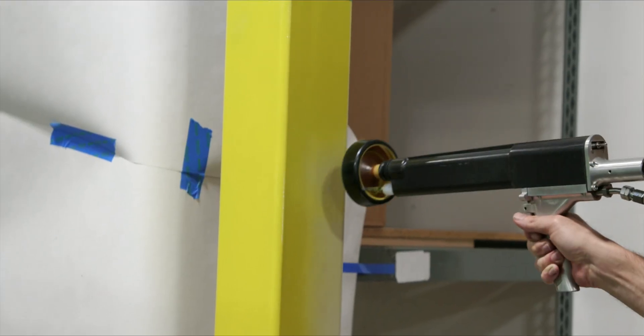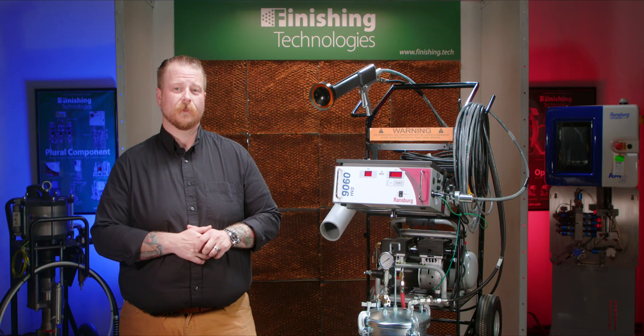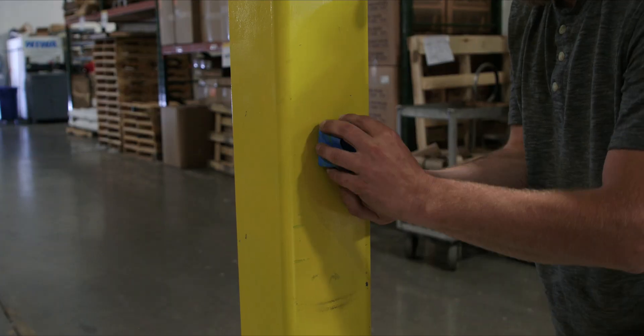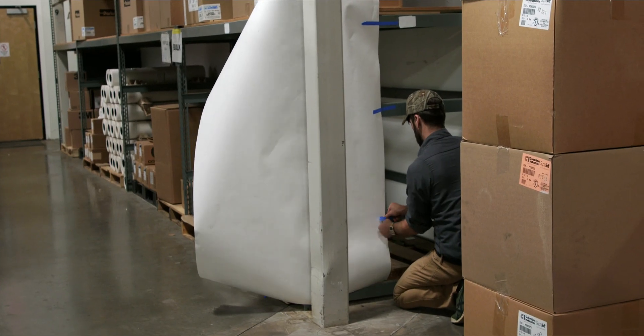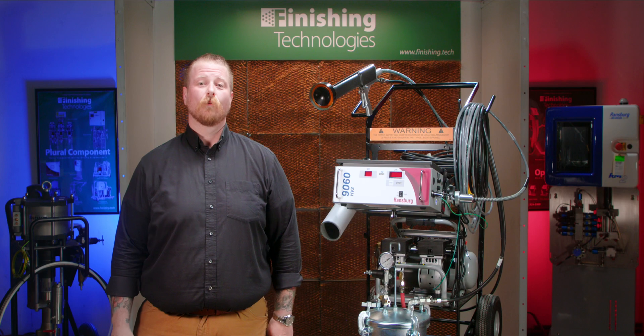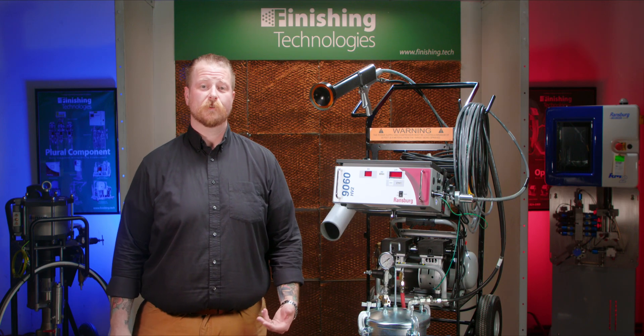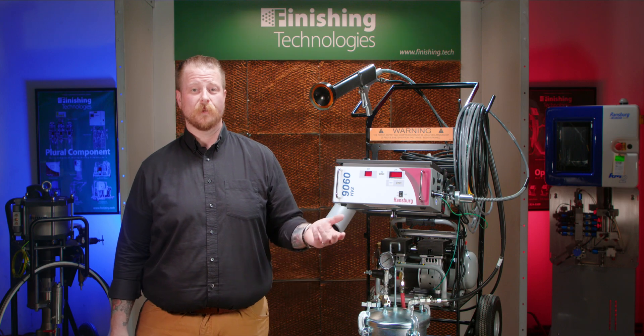It is best if the painter uses circular motions while painting. When the paint exits the bell cup, it leaves a unique circular pattern, so a circular painting motion helps fill in the center. Prep work is typically as simple as doing some minor masking off around the item being coated, as well as ensuring that your surface is clean — and that's pretty much it. While the Process 2 moves a bit slower than traditional atomization tools, the reduced prep requirements combined with the ability to coat in the field are all where the real savings lie.